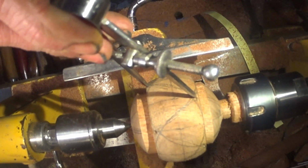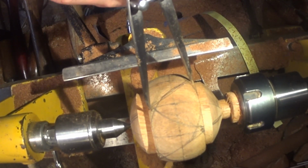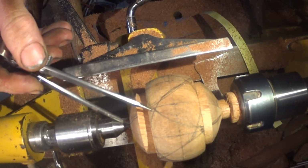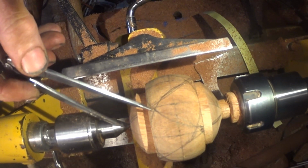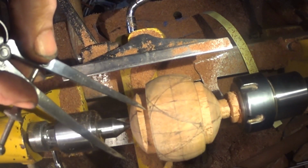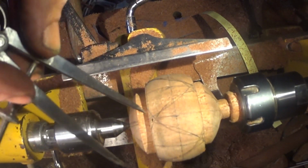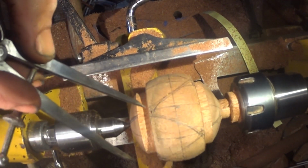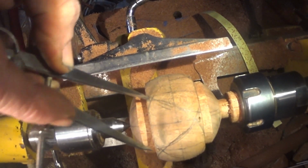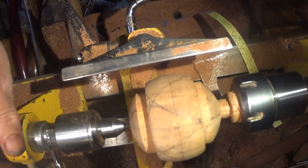So that my centres are all correct, and I've also confirmed that every centre in this hemisphere comes back to the centre. It's giving me more confidence, you know. There was some minor corrections, and also I've parted the grains where the grains are trying to deflect any drilling operation into there. I've made sure that I've parted the grains so that the drill has got a much better chance of giving me an accurate hole.